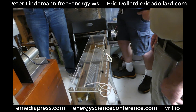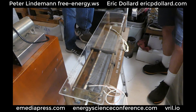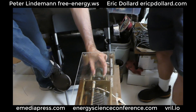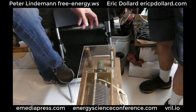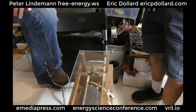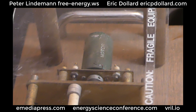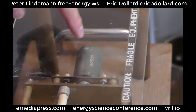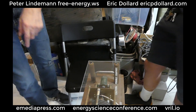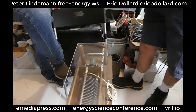I can't just pull this stuff out of my head. Of course you can — well, I could at one time. The contacts for driving the motor are right here and here. That's a simple DC brush-style ordinary motor. That's how to turn it — not a big deal. You could put an optical spot on this black thing here so you could get a sense of the RPM with a photo tach. You can figure out the RPMs pretty easily.